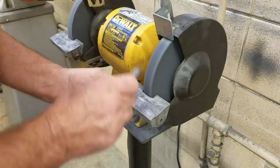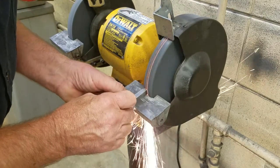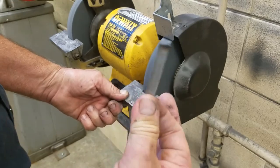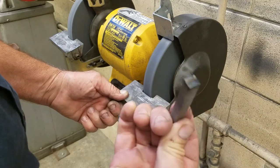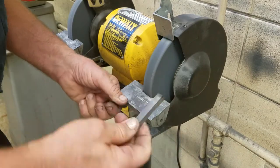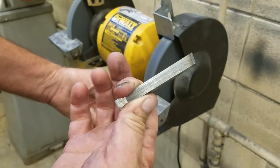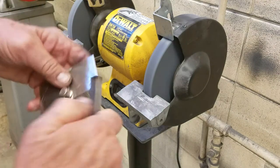In the previous video I used the other wheel which was a little bit finer — it's a little more difficult. Now I'm not worried about this getting blue; this is not high-speed steel, it's just common steel. I want to be able to learn the procedures. When you're done with these common steel practice bits, make sure you throw them away, because you'll stick them in your box and go to cut something someday and they won't work.